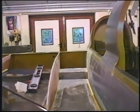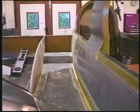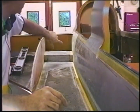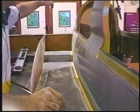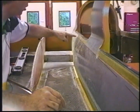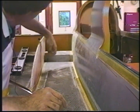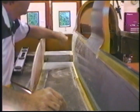Okay, what we're doing at the moment is we're preparing to wear your fingertips right down to the bone. This entire area, from the baggage aft bulkhead here, all the way to the back, you're going to sand every square inch of this interior. The bottom, the aft face of the wheel well, the forward face, the top, this section, all the way to the underside of your aft canopy lip. You're preparing to lay up 7 plies of BID that's going to go from this corner all the way to this surface area aft of the BAB and the front face of the spar.